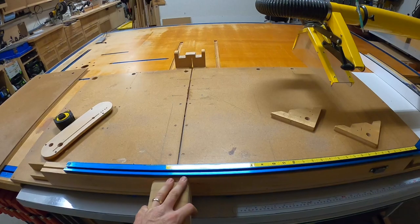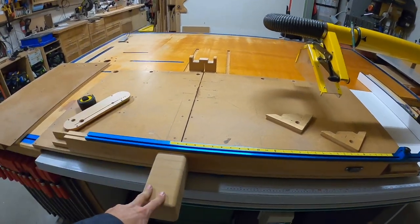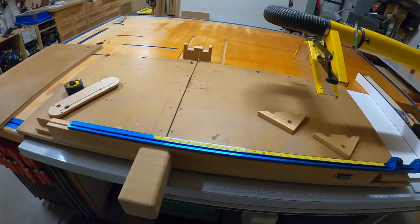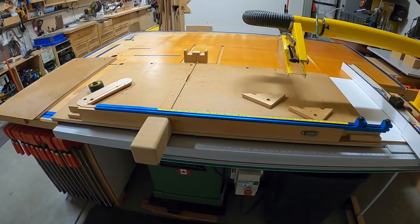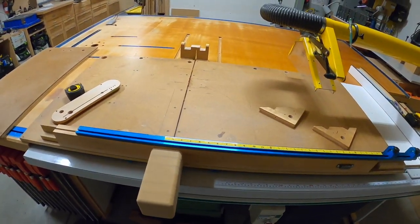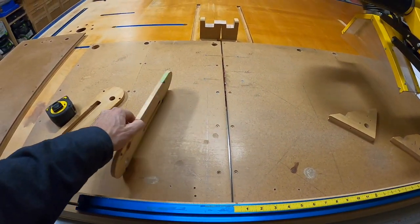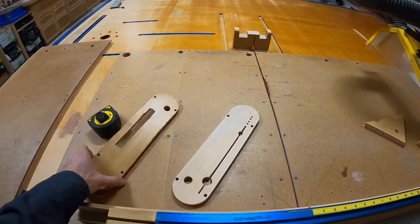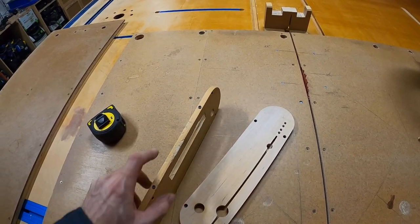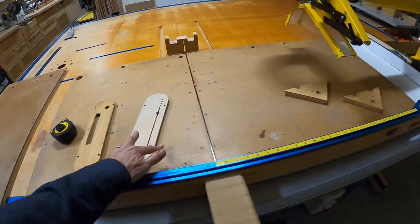That's a tough one when you have so many changes in humidity and dryness. We don't live in a very humid area but it can be really dry — like 4 or 5% humidity. When that happens, it's amazing how much stuff shrinks. Even my throat plate inserts shrink a lot, so I'm constantly having to adjust. That's why they have screws on the sides to accommodate changes in humidity — I just take a quarter turn or an eighth of a turn and it locks right in.